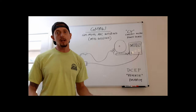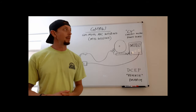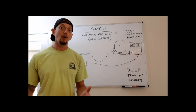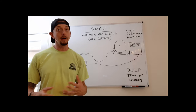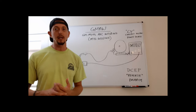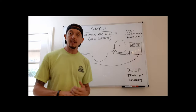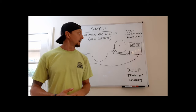There are many multi-process machines (CC/CV) available now. One challenge has been doing both CC/CV and alternating current for aluminum TIG welding, though newer technology is improving this. Up until recently you had to choose between stick/TIG or MIG/flux core. Multi-process machines are available but the choice depends on what you plan to do most and how much you want to spend.